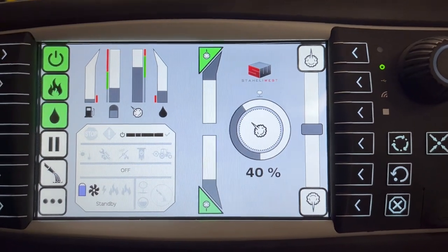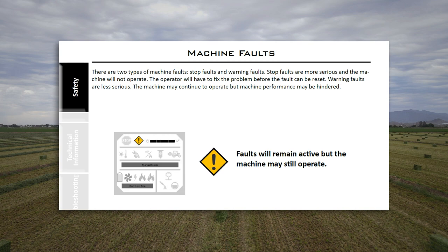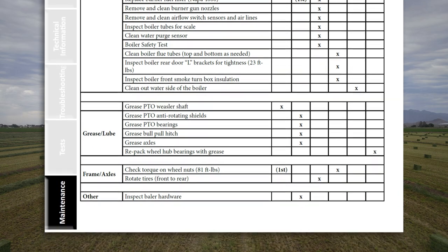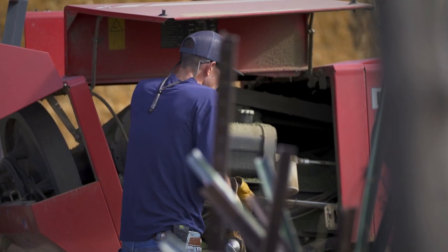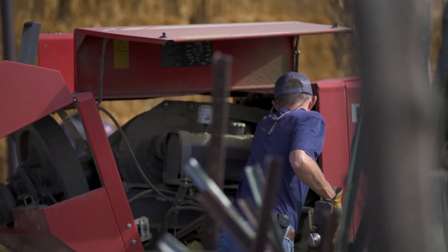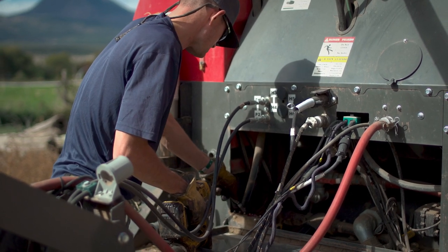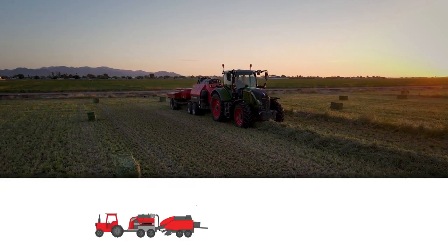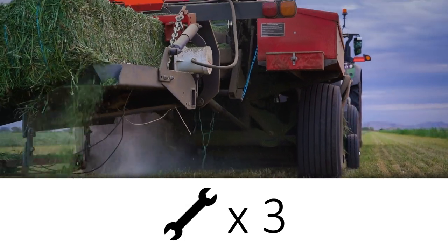Red stop faults have to be corrected and reset or the machine will not operate. Amber warning faults will remain active but the machine may still operate. All of the long-term maintenance for the steamer can be found in the maintenance schedule in the owner's manual, which also shows step-by-step instructions for each maintenance procedure. Along with steaming hay comes added baler maintenance. Remember to blow off the baler and steamer each time you fill up the steamer with water. With more moisture in the baler, it is very important to use a high quality grease. Also remember to service the baler based on the bale count — a baler behind the steamer will often be used three times as much as a standard baler, meaning maintenance will be required three times as often.